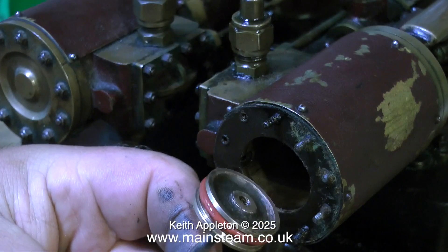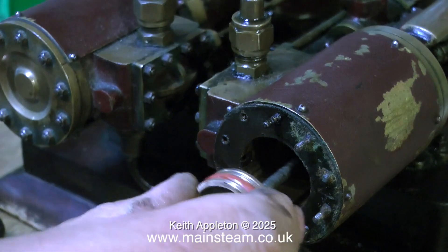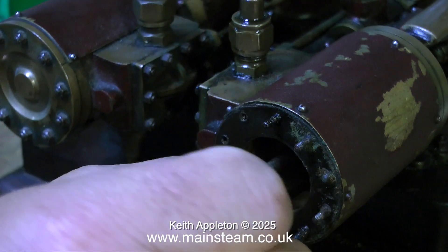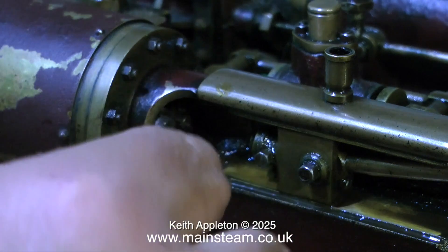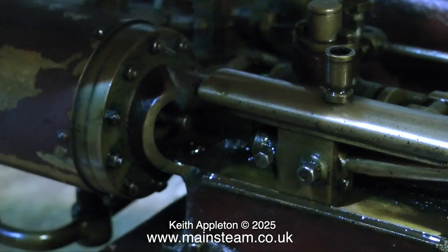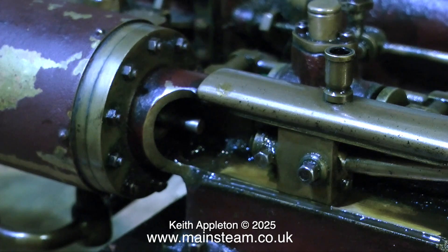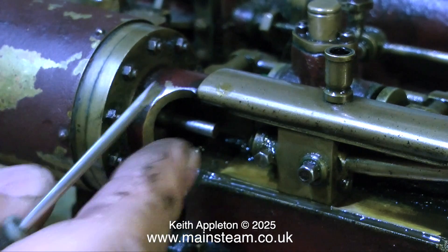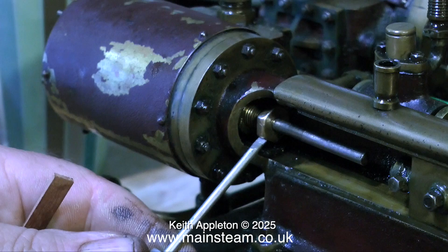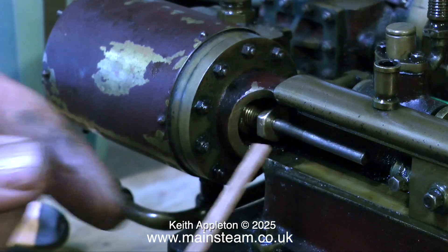The bore of this cylinder is one inch in diameter. And here is the re-grooved piston fitted with a one inch outside diameter silicone O-ring. Normally refitting a piston is a very simple job, but this was difficult — it would not go in. Then I found all the string, or cotton — it's very fine stuff — still in there. Once I pulled this out, the piston rod came through fine. I simply replaced it with some proper graphite yarn. I was going to use an O-ring, but I thought I'd be a traditionalist, mainly because I've got some proper graphite yarn that I unpick from a full-size piece of graphite yarn, and it's really good stuff.